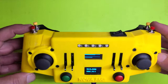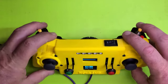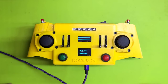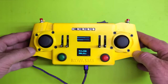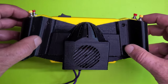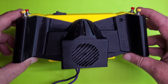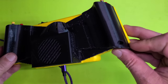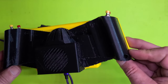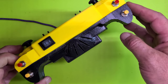Ah, that's it, guys. I reprinted my front, and I was propagating for you guys to print everything standing up like that. But for my front this time, I decided to print it flat on my bed. My back was printed standing up. Because it was printed standing up, it drooped a good 2 millimeters as it printed. That would be my guess for why it's not the right size and shape, just off a little bit. Even in these directions, it seems to be drooped a little bit, just at the bottom points. Top points are fine. So yeah, that's my guess, guys. Maybe printing up like that is a bad way.